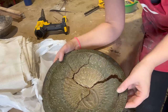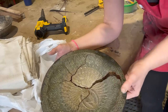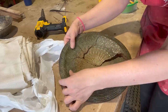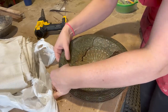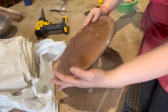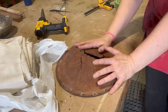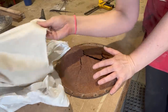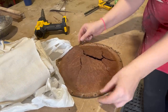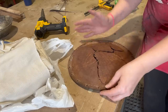You can get a lot of different pressed paper seats still these days, but this one is so unique with this pattern, I just want to repair it. And so we're gonna be putting these back together with just a carpenter's glue, which is water soluble, so it'll work really well. And then once those are on, I'm gonna be putting on painter's tape across to bridge it while it dries. Once that is dry, I can take the tape off, and we're actually gonna be gluing a heavy body canvas across this whole surface and onto the tack strip, because that will hold the seat and support these breaks.